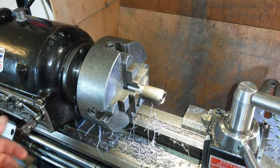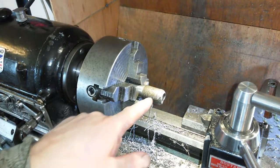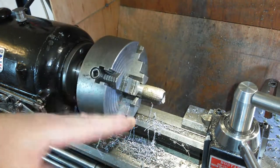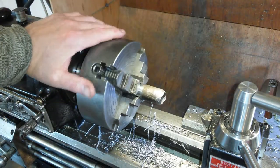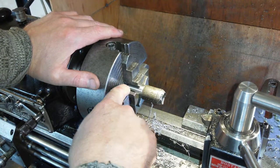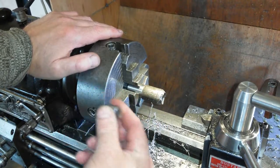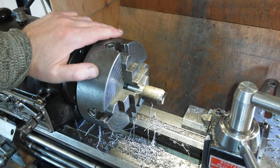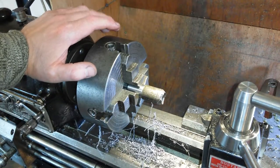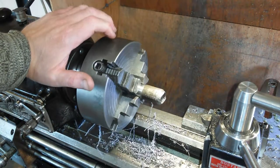So this manky looking piece of steel was a pivot pin with a grease hole in it, and I thought it was just rust, but this side here that's cleaned up was long enough to make the cap for this, and this came off the other end of that as well. But it ended up that one of the what looked like a rusty around section, I managed to push a screwdriver all the way through the centre of it, so that's where the grease fitting would have been for the pin. As we can see, the pin must have come loose and it got wallowed out quite badly.